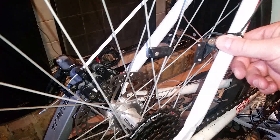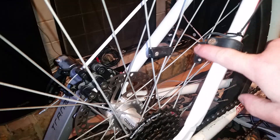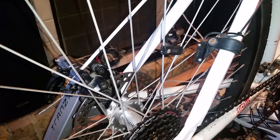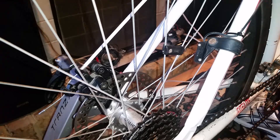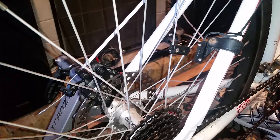This is the wheel speed sensor from a cycle computer I had about 30 years ago. It's just a reed switch, with wire coming away from it, and a magnet mounted on the wheel. As the magnet passes the reed switch it triggers it, so you know each rotation of the wheel. You time between those triggers and work out the speed in miles per hour or kilometres per hour using the wheel diameter.